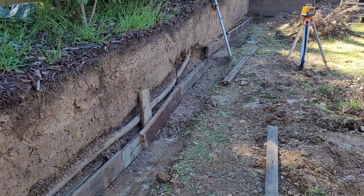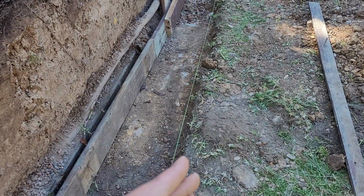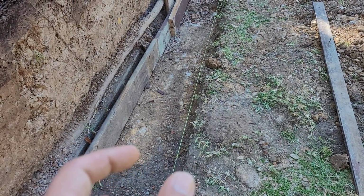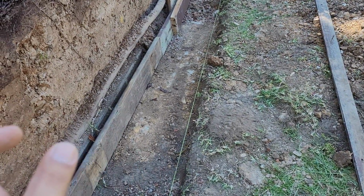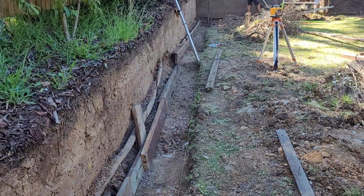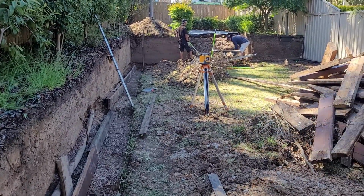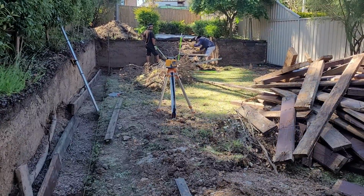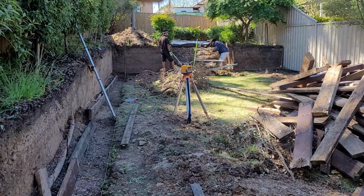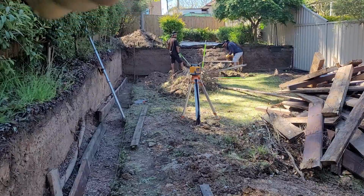concrete footing. The concrete footing is 450 from the end, and we also have 100 mil that side, and then the block, and 150 behind it. It continues there, and then turns to the side. Also we have stairs. We continue the wall through the stairs. The first stair is the first course of the wall, and then we cut it and go on top.